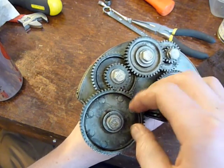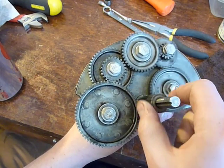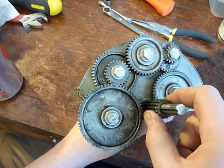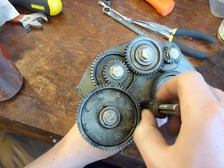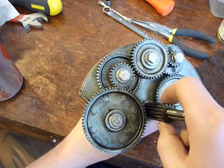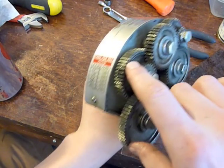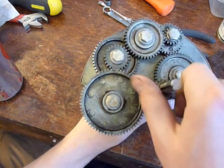I've cleaned it all up, but I'm realizing now that something's wrong. As you can see I'm spinning the gear which is driven off of the spindle and I'm getting rotation out of one, two, three gears, but that rotation is not continuing through to the set of gears here nor this one. Something's definitely wrong because these two gears are required for the 3 thou and 6 thou feed per rev.